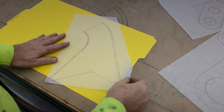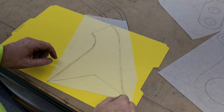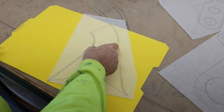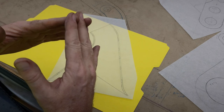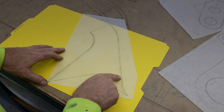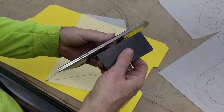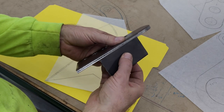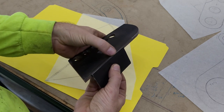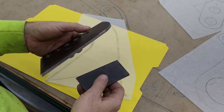There's an eighth inch of extra space here on either side that I've got a line on, and these little divots — the plan was if this was going to go to a laser cutter, you'd want those divots to help line everything up like fingers when putting pieces together. But I'm not doing it laser cut, so I'm going to cut it to the inside edge, which is an eighth inch shorter. The reason is so that when we put the pieces together, I've got a nice trough to weld into. I want to make sure I don't have any more penetration issues like last time — learned from my mistakes.